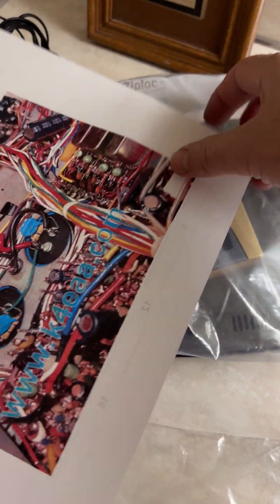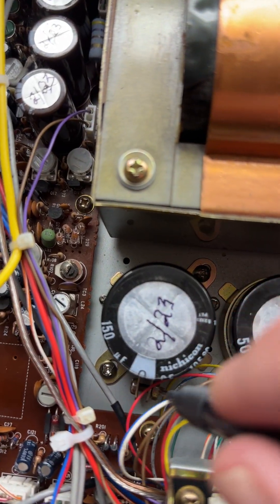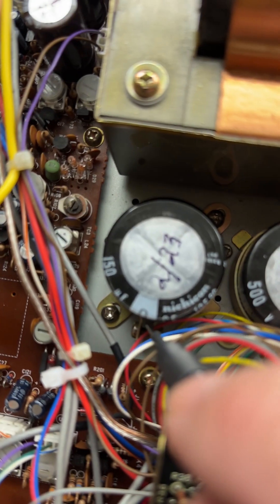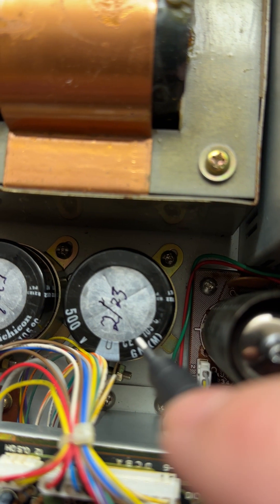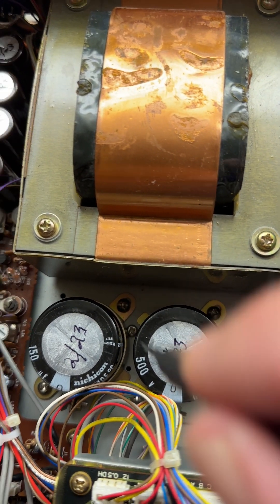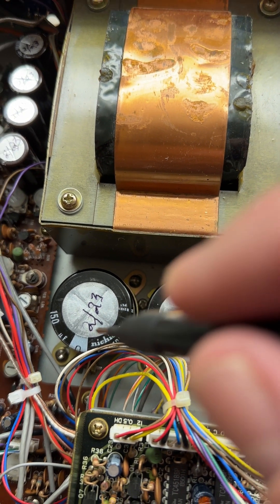On the bottom side, I'll show you here — you're going to have something similar to this. So take a picture; you've got to make sure you get this right. What I did is I lined the negative of the new capacitor up with where the little screw is that tightens this clamp onto the capacitor. Line those both up and face those down, and that's how I installed those — that made it easy.